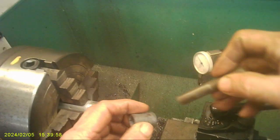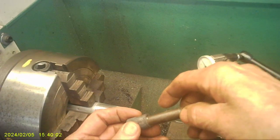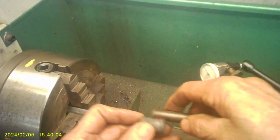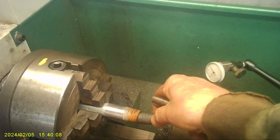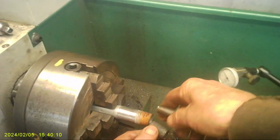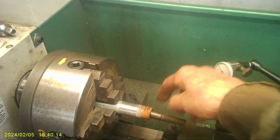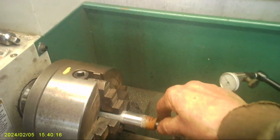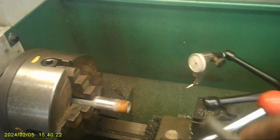This is the socket. I heated it red hot to take all the temper out of it. I'm going to put this in here — this is going to go inside there. And then I'm going to turn this down so it'll fit right inside there. So when I'm all done, it'll look sort of like that. And then the bearing will be on this part right here. We'll get into that. Let's clean out this inside and make it pretty.